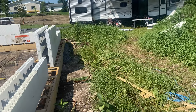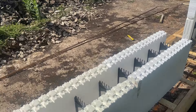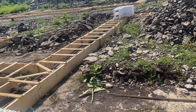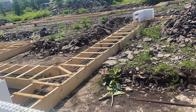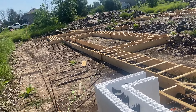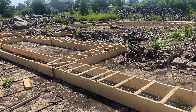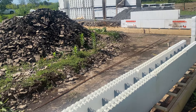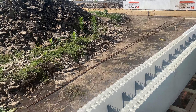One of the key things: when you put your corners, you put ICF in each corner and they come to center at your common seam. You start one ICF corner — you can see this is the short end, and on the corner there's a long end. You stagger them — if this is a short end here it's going to be a long end facing it, vice versa everywhere. You only need to worry about the first two layers; if you get the first two layers squared and perfect, it goes all the way up.